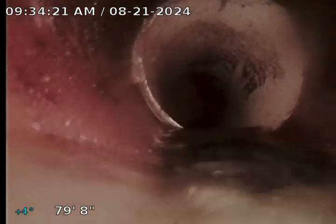Okay, as you can see here, we do have water flow coming through with the laundry being ran. It's just a laundry tub in the basement. We are going to go ahead and televise downstream again to see if we can push past. You can see here we have another PVC repair. We want to see if we can get past that area that's right around the city main and see if we can get a better idea if it's just a matter of tree roots or if it's something else that's possibly been broke off. Again, here you can see this is the start of it.